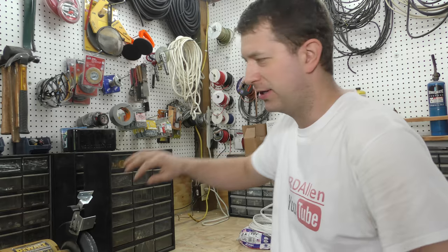Hello, I'm Rand here, and today we're gonna be working on the electrical out in the barn again. If you watched the last video, I mentioned at the end of it we're gonna be adding some additional circuits to the outlets along the workbench and on the shop side. So we're gonna be splitting what is currently one 20-amp circuit into three 20-amp circuits.